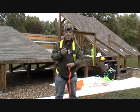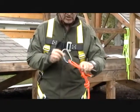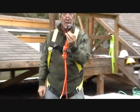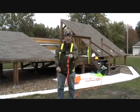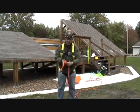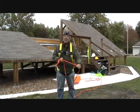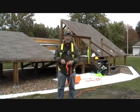So how does this get used? Easy. We put this carabiner into the bite on our figure eight on a bite. Now we have something very similar to what we had before with our safety bucket device — this can go right to an anchor point. However, remember that with our safety bucket device, we had our fall arrest built into the end of the lifeline. There's another way we can deal with that.